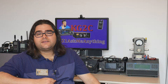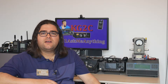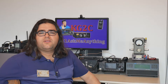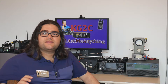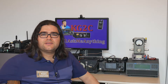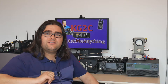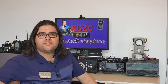Starting with my favorite, the BNC connector. Amateur radio doesn't use it a whole lot, but lab equipment often has it because the BNC connector is good up to pretty high frequencies and can be used many times. They're very easy to put on and remove — it saves time. In a portable operation where I'm setting up several times a day and breaking down that station, it is easier to use the BNC. Also at home when testing and switching connections — for example, switching one antenna between several different radios — it's just easier. Another advantage is that it lasts a long time compared to an SMA connector and can take much more abuse.